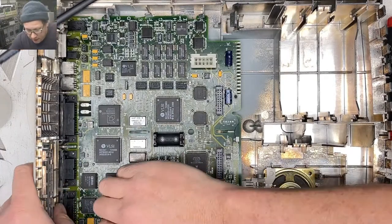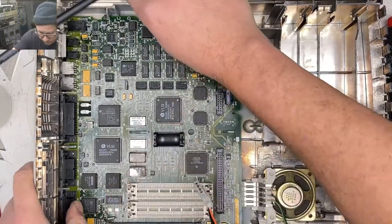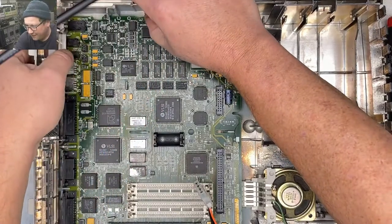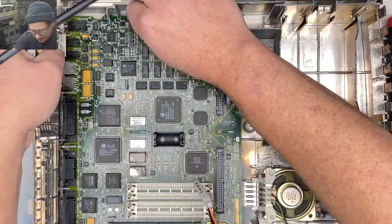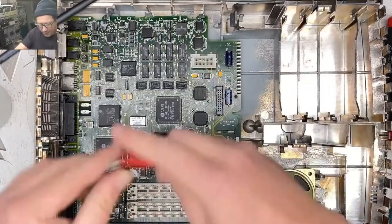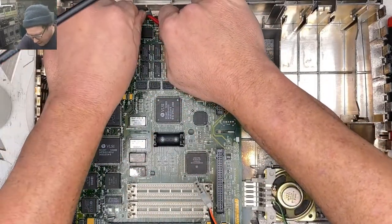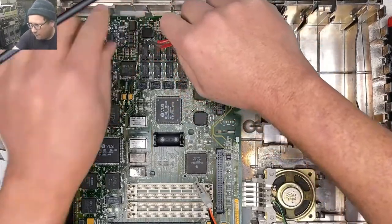The 2CI motherboard has capacitors like these that need to get done, like all these systems do. But it has a soft power on circuit that can get a little funkified from the bad caps. So that can cause issues with that.